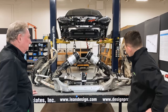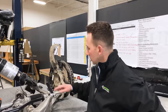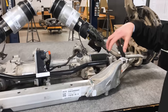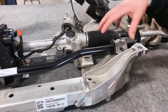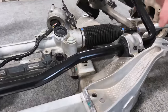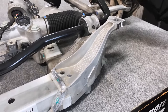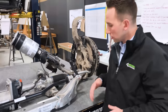Sure. So there are some key differences we'll talk about as we go through the rest of the vehicle. Right off the bat we noticed the cradle. In the last gen it was still an aluminum cradle, but all the nodes — the corners of the cradle or subframe — were all sand cast. We can tell these are die cast by the types of features we're seeing, the level of granularity or fidelity in those castings.